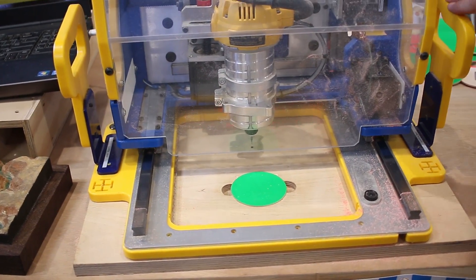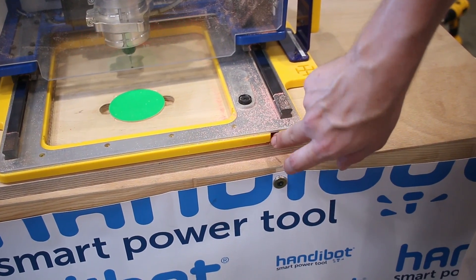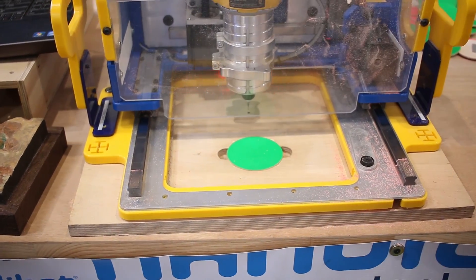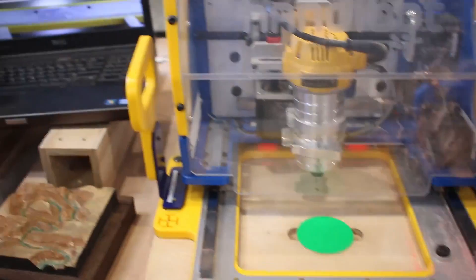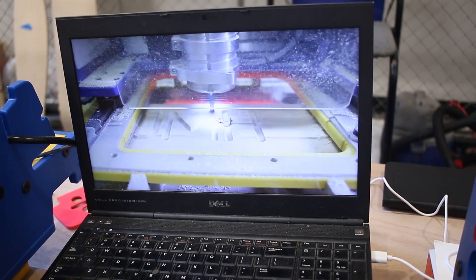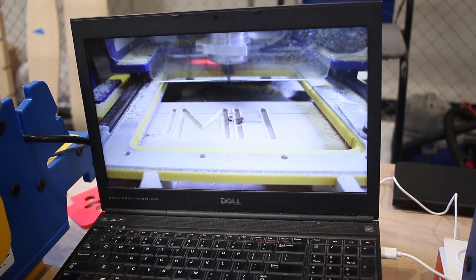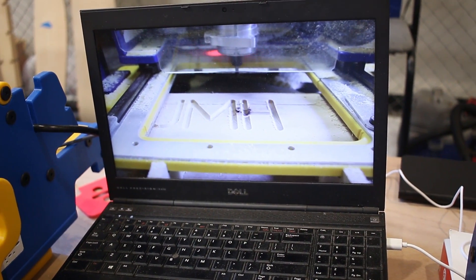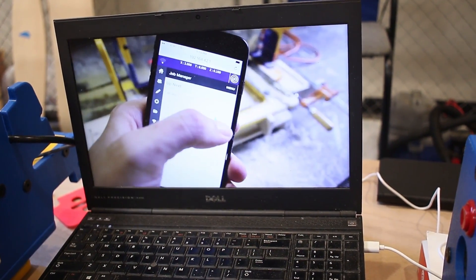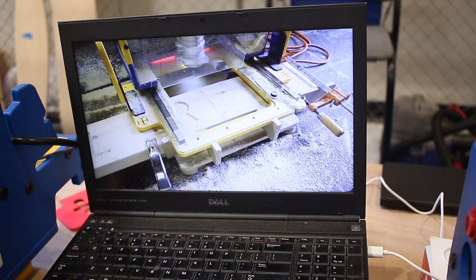How do you locate between cuts? The most popular locating feature is up in the front — you insert a key into the front of the tool, and you insert that key into a rail that has V-grooves in it. So you move it along the rail at 6-inch increments, and that rail is something we also provide to people that buy the tool. You want to locate it and clamp it down between each cut. Here I'm showing making some trail signs for a local trail system near my house. I slide the boards through the HandyBot and cut out the letters for the trail sign in increments — I'm able to do 20 or 30 trail signs in an afternoon just by sliding my 2x6s through the HandyBot.